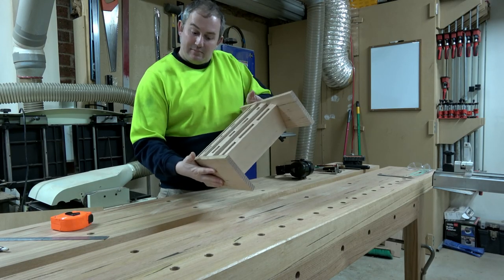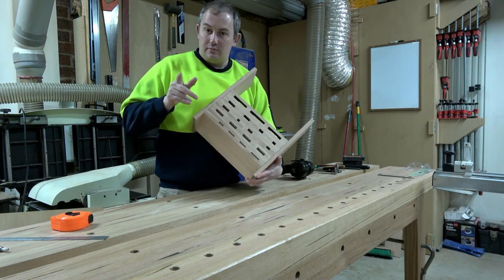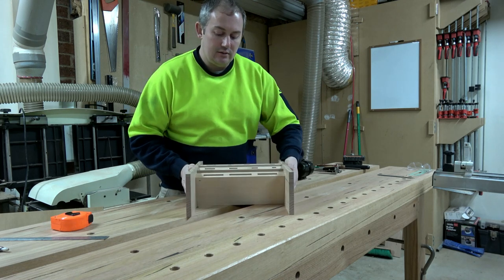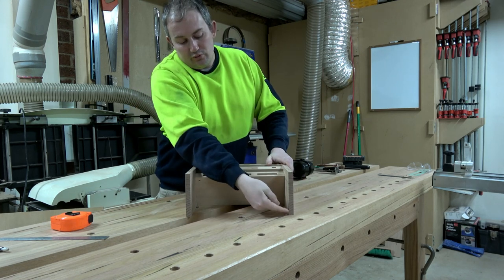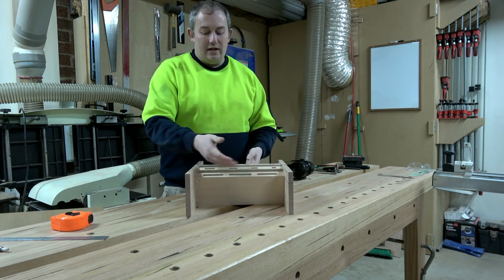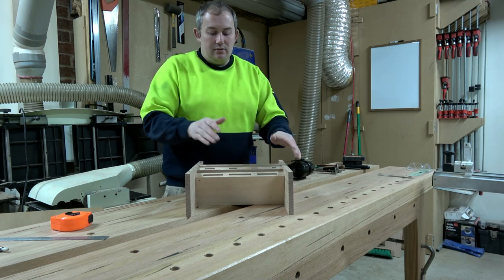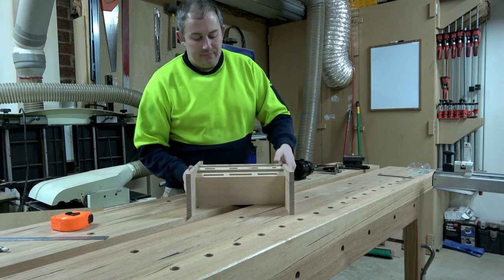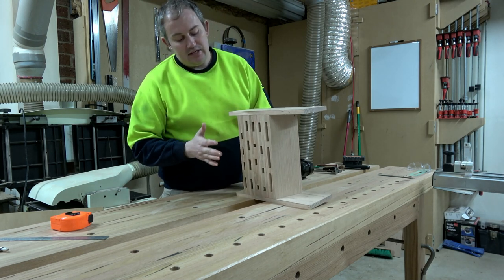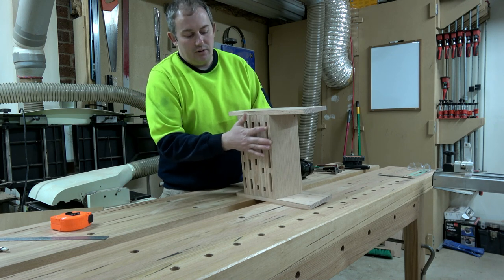Right, so everything's coming up swimmingly. It's all good. It's flat on the bottom, and that was a mistake. I forgot about that. To put a tray into the front here, what I wanted to do is I wanted to put a groove into the sides and slide a bit of plywood straight through all the way under it. But that means all of this center section had to raise up, or the sides had to drop down. But because they're perfectly flat on the bottom, what I'm going to do instead is I'm still going to put a bit of 5mm ply or 4mm ply on the bottom.